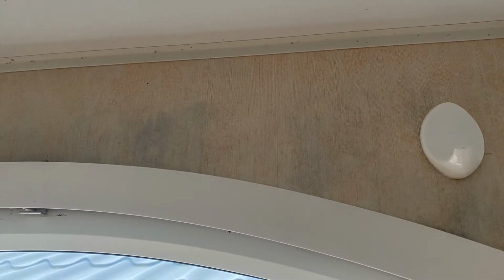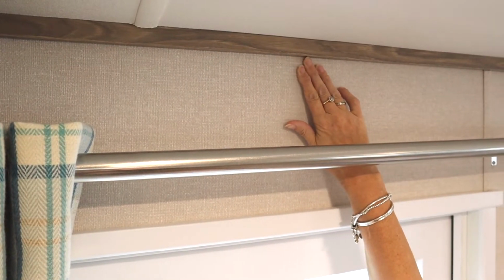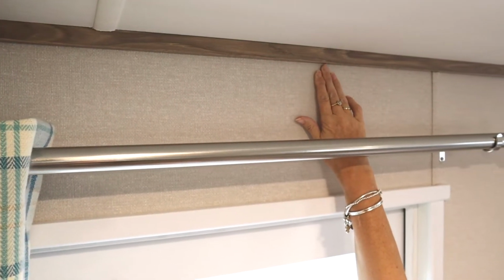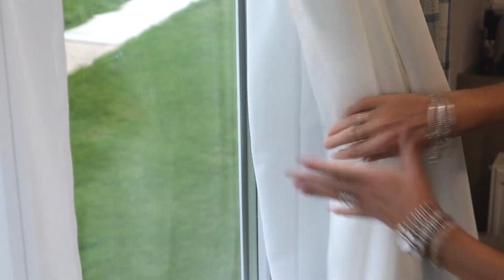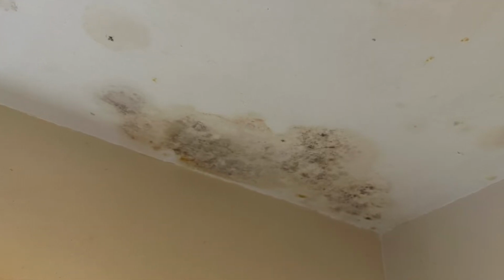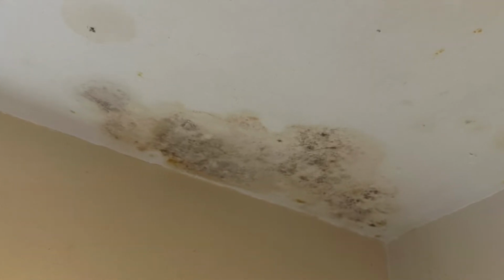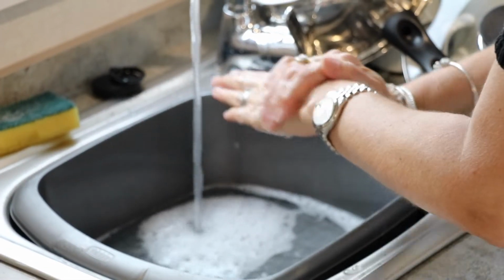Look for water stains, peeling wall boards or discoloured patches on walls or ceilings. Touch the area, and if it feels cold or wet, it's likely you have found the problem area. In extreme cases, the surface might be spongy. If you have any soft furnishings in close proximity, including curtains and carpets, pull these away to inspect further. Unpleasant mouldy spots can form in clusters next to a damp area. If you have touched any damp or mouldy areas, wash your hands in hot soapy water.